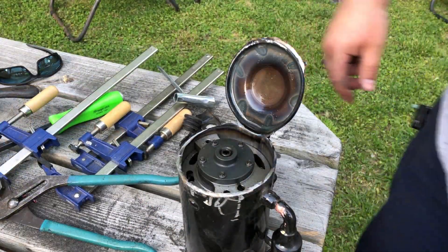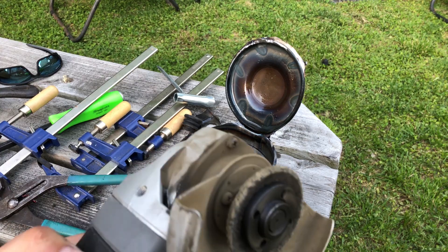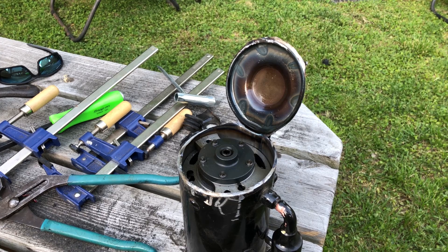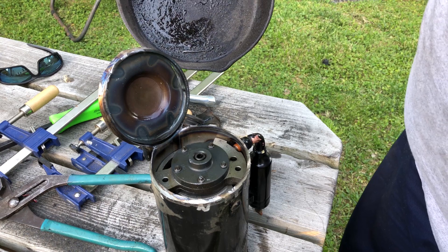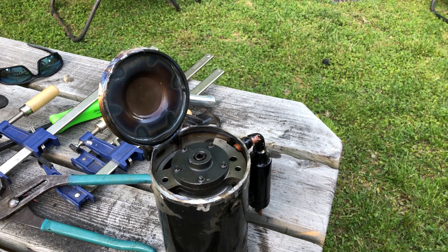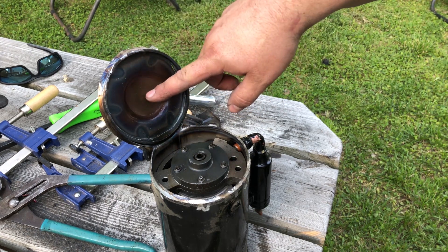I had to open it up the rest of the way - a little redneck-ish because my grinding wheel disappeared. I didn't want to show that on film because that was kind of gross. Now one thing I'd like to note here: we barely got any oil out of this thing. That oil went somewhere, probably in the condenser. So now the new system has extra oil. The oil was probably a very large contributing factor.